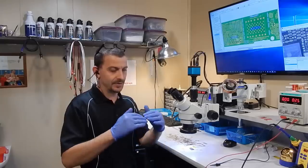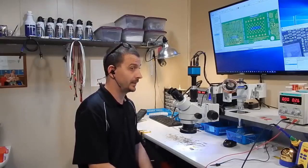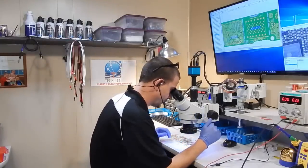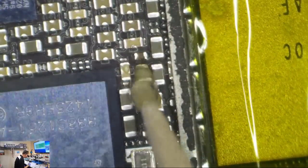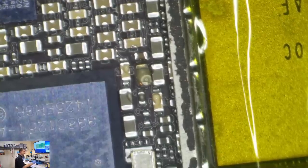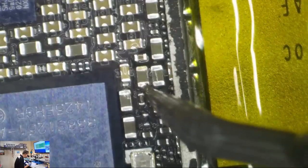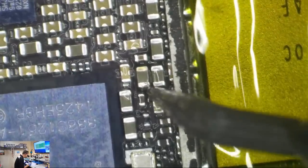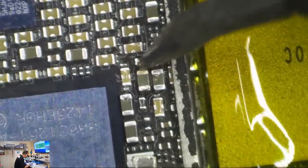5 amps through that little bitty cap and it was that hard to narrow down the heat source. Maybe I should start using freeze spray. When it comes to data recovery, I'm not nearly as bold with putting power into the board. I try to track it down the best I can and use heat techniques as a last resort. Since I don't have my mini hot tweezers yet, I'm getting in here trying to use my iron to tin both sides of that capacitor to lower its melting point just a hair.